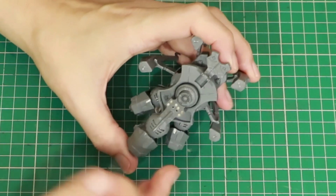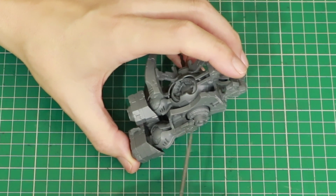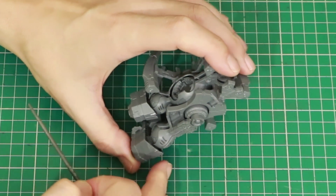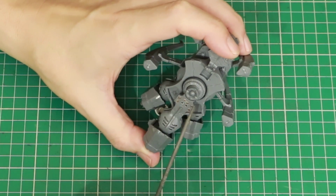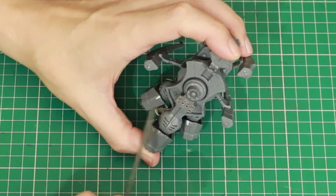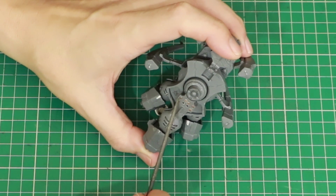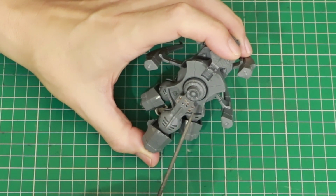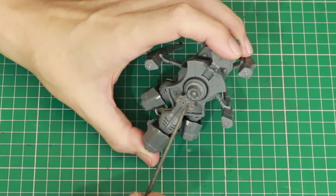Okay, so I'm all done. I drilled out the 4 holes. I didn't go all the way through. I went deep enough to get the magnet in and it was flush. I then drilled 2 holes just here. I didn't quite get them in a straight line. A bit annoying, but makes no difference to the actual magnetising. And then on the other side I glued the corresponding 5x1mm magnets in the 3 areas, and then I magnetised it on, and whilst it was okay, it did wobble a little bit still.